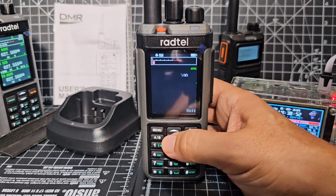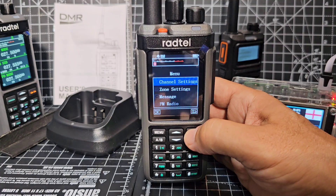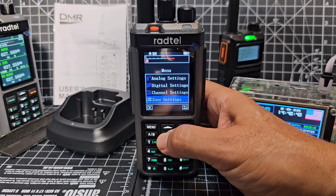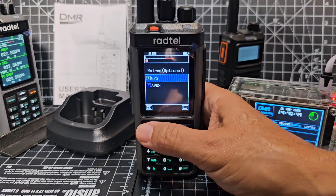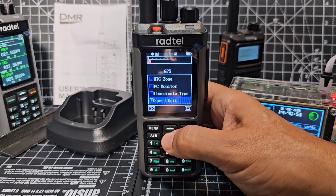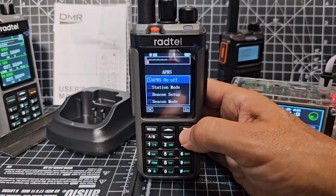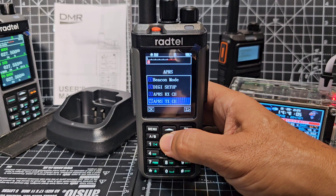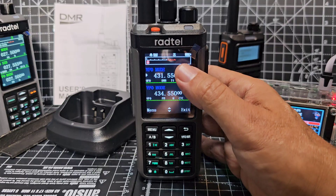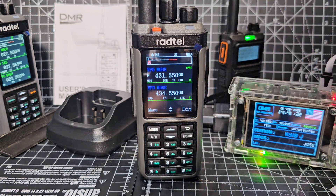You set your settings by going menu and going down to channel. Channel set is there, and there's your transmit tone. Type the frequency as normal, set your shifts. Let's have a look at the extended functions - go to menu, keep going down until you see extended. This is where you'll find your GPS settings. Turn it on. You've got baud rates, PC monitor - I'll show you that on another video. And going down: APRS. I want that off at the moment - I noticed it was on. You can see your station mode, beacon setup, digi setup, APRS receive, TX, demod tone - all the settings you'd expect. Let's connect this to the computer and see if we can add a few bits and get it receiving some DMR.